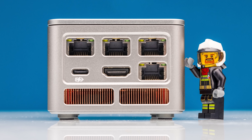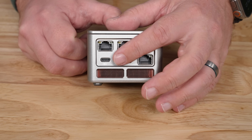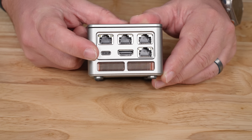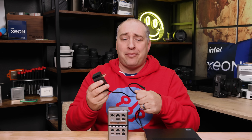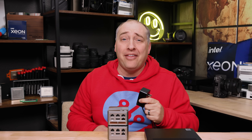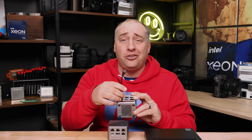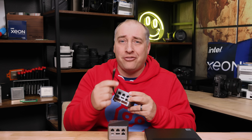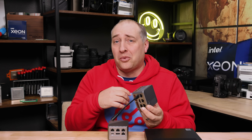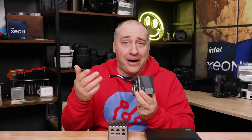There are some other features on the back. We get an HDMI 2 port, so if you want to run a 4K display off this you totally can. You can also power this via USB-C, but there's a catch. The included power adapter is a 12-volt USB-C adapter. There's also a USB-C to DC barrel jack cable included, so if you want to use a more standard power supply you plug that into the USB-C port. I think a lot of folks are going to want either a standard USB-PD solution or just a standard DC barrel jack.